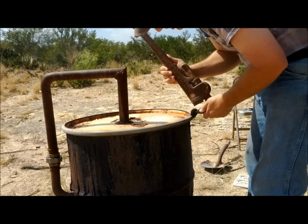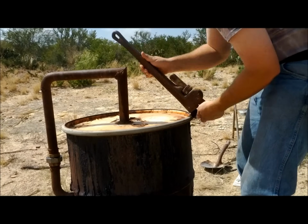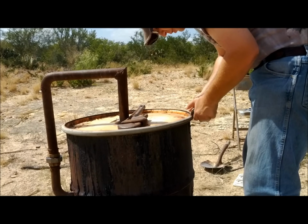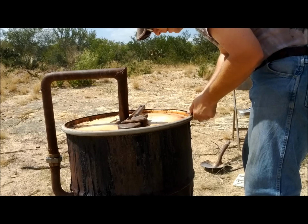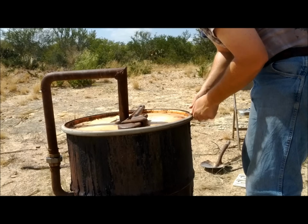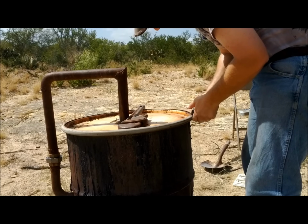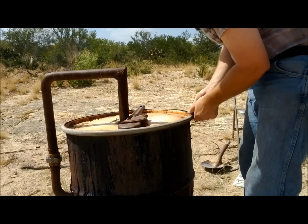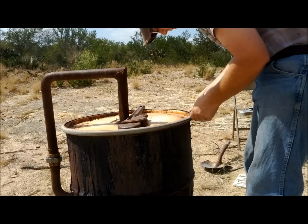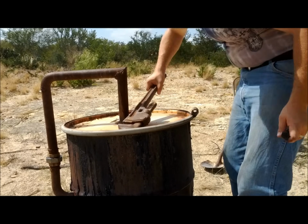and because if you open the retort chamber, the charring chamber, too soon, the charcoal inside will have enough heat on its own. Once the oxygen touches it, it will flash ignite. Plus, all this is just too dadgum hot to be standing too close to when it's still hot enough to flash fry or flash light. Auto ignite would be the technical term.